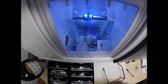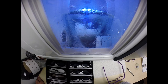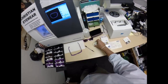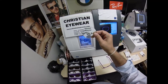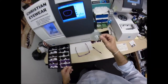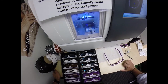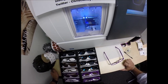Water has begun spraying — that tells me it's in the last 20 seconds of the cutting cycle. Now out comes a lever with a smaller disc, a very fine disc that's going to put the safety bevel on the rear concave surface of the lens. You have the Photofusion Blue, which will turn blue outside but also gives you 30 to 40% blue light protection. You have the DuraVision Chrome anti-glare, which is three treatments — it reduces glare when driving at night, particularly in the rain, but also from computer screens, overhead fluorescent lights, and stoplights.